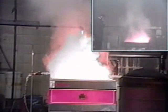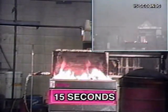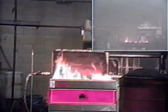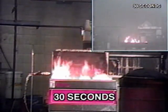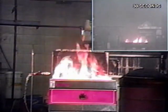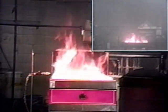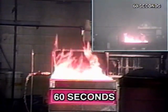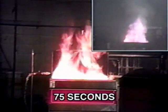This third sequence shows both fire tests simultaneously. You'll be able to clearly see the significant differences in pre-burn time and flame intensity between the more stringent UL300 test on the left and the previous test method as shown on the upper right. The added requirements to minimize the splashing of hot cooking oils also play a significant role in the longer extinguishment times and increased agent quantities used in today's UL300 systems.